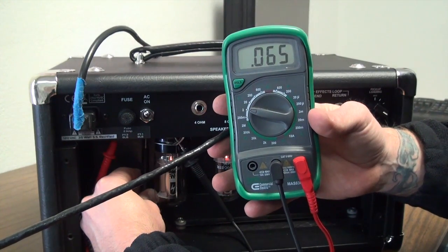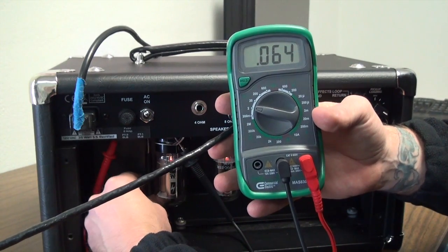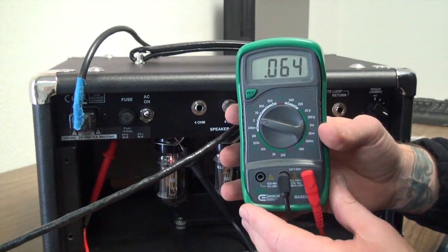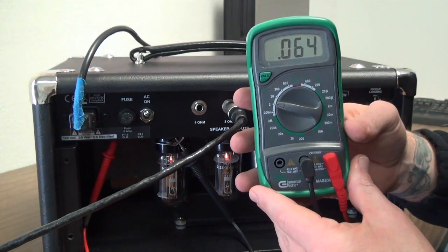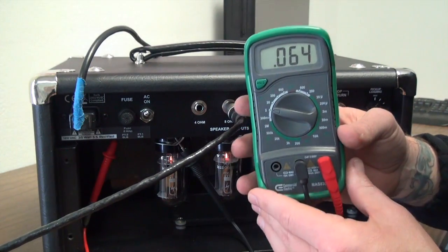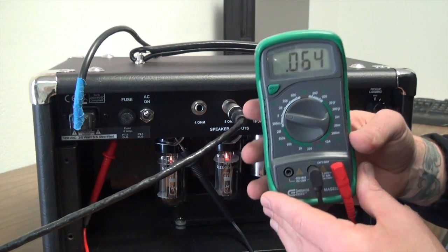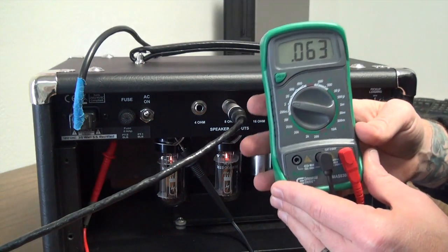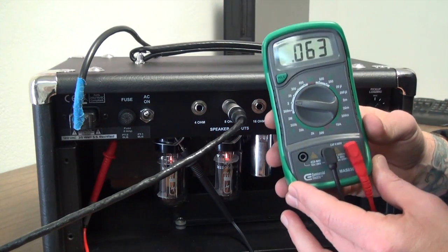So as you can see, I've got it set to 0.064. It's going to fluctuate a little. It's totally fine. Now this is the coldest setting I recommend. Otherwise the amp's going to start sounding flat and flubby, maybe even a little farty. You can take the bias hotter depending on your tubes, or if you're starting to look for output breakup. But for all intents and purposes, we design around this spec, and you're going to get the most clean headroom right around this range.